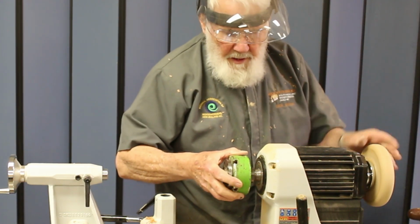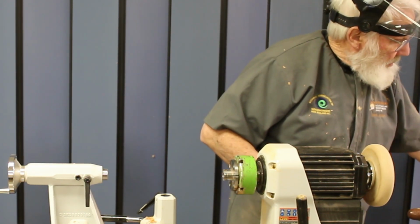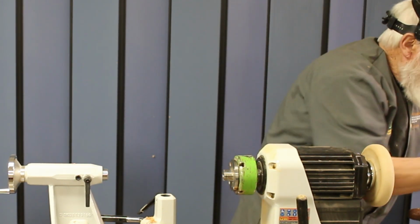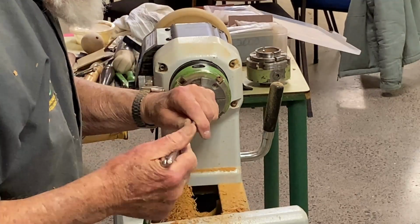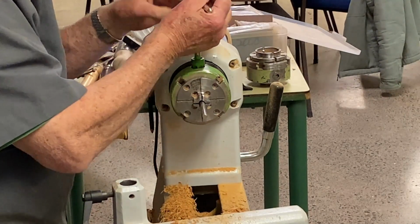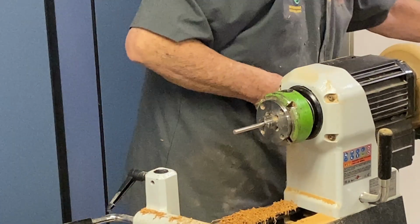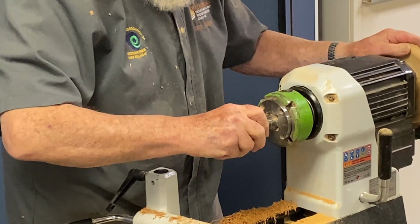And we'll put on here this time a chuck with a jaw that will hold our new piece of steel. Again, we'll turn that up and let's put our bit of steel in here so that we've got enough out for our sphere to be glued onto the end. So we need to glue it firmly on there.